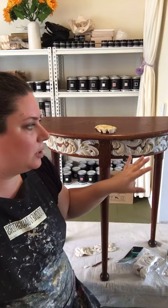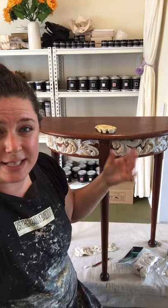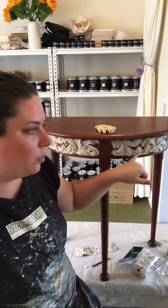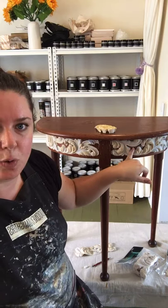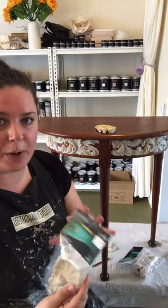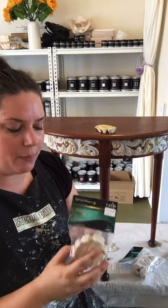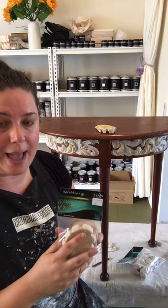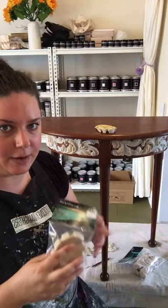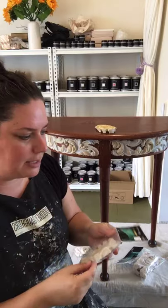One other thing with the mouldings and the glue: once it's on and it's been on for about 10 minutes or so, you can paint straight over and it will be fine — it'll be fully dry, and chalk paint will cover up any markings. My chalk markings that are still on here will all just come off, and you just paint like normal. The other option is you can pre-paint it and then glue it on, but if you're doing it that way just be really careful of your glue outlines and do it really carefully and slowly.